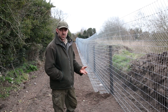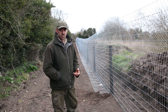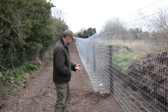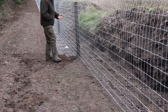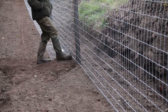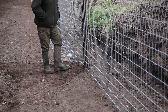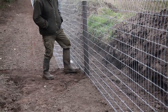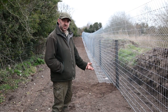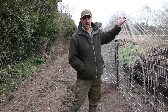If you leave the fence or the ground skirt uncovered like this, they will be able to see it and therefore find a way in - so it does need to be covered. I can't stress that enough: if you leave it open, they will find the way in. In springtime - March, April, May - the grass is growing very quickly. If you're going across a field you can potentially just cut it as low as possible and it will grow back within two or three months. But if you're working on bare soil as we are here, you definitely need to cover it. It doesn't need to be covered very thickly - just get a shovel or rake and literally just cover lightly over the top.